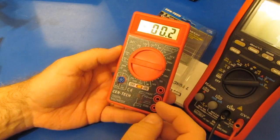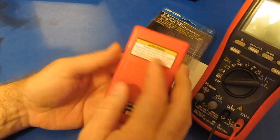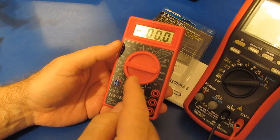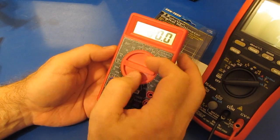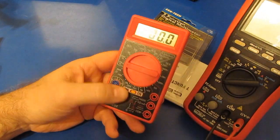So in the previous two videos, all I was doing was taking the meter apart after so many cycles and then inspecting the rotary switch. I ran a test where I tacked a couple of wires onto the back of the contacts, and then used an external meter to measure the contact resistance while I was cycling it. I plan to do the same thing with this meter.